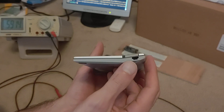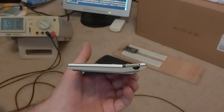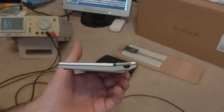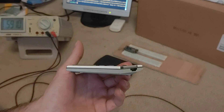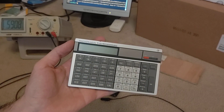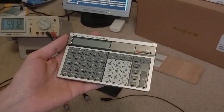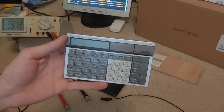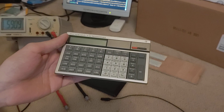Over here is the two-line serial output that I'll probe. Unlike the Voyager series calculators, with the TI-66 you could print to a TI-PC200 printer, which I have and I'll demonstrate in a future video when I review the TI-66. What I want to build eventually is a Wi-Fi interface for this using an ESP8266, as well as one for the TI-95 that I'll also be reviewing in the future.